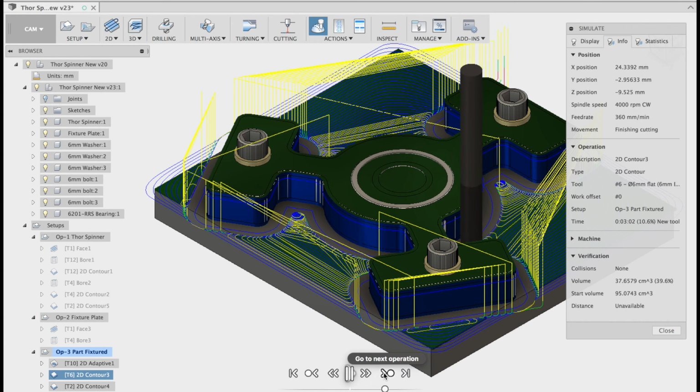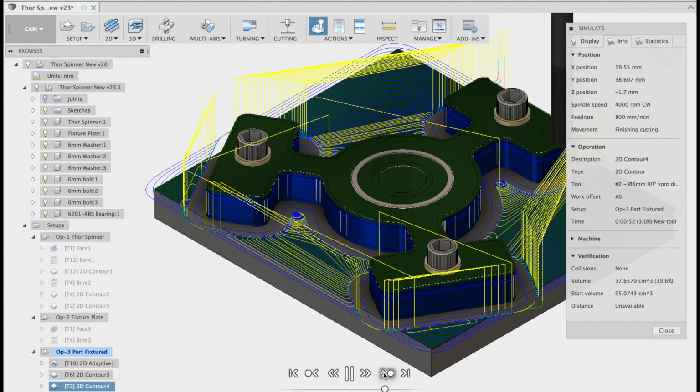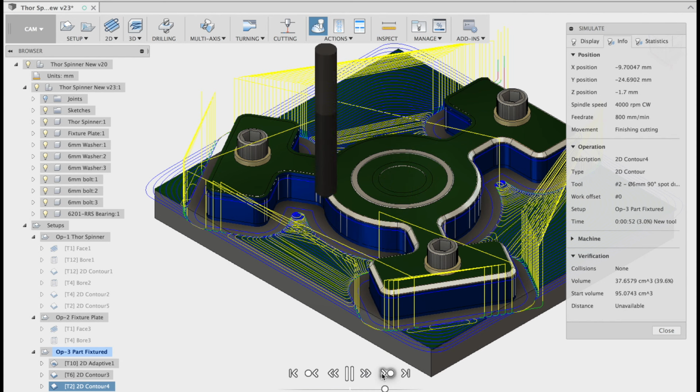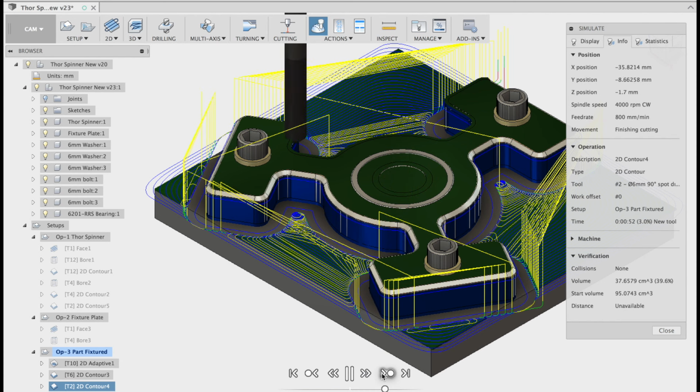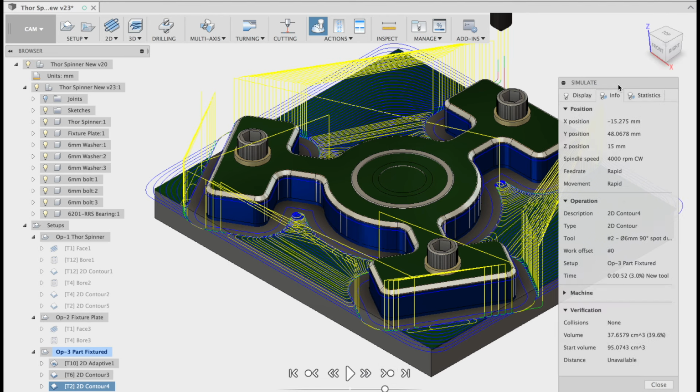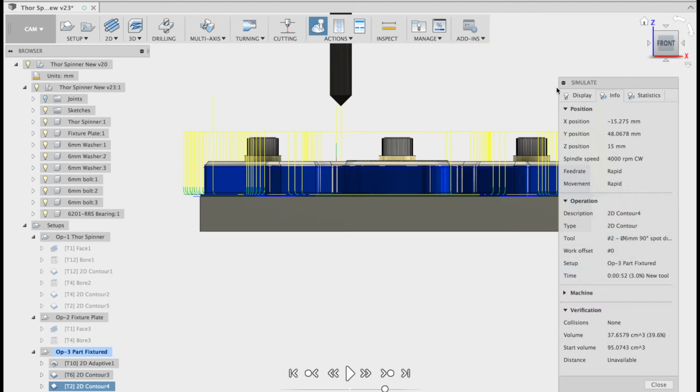We then come straight in now with, I think we do two passes of that, we repeat the finishing pass, then we come in and we put that lovely chamfer on the outside. That contour. And you'll notice here, guys, that in my heights, I've actually ensured that I set the height up so the chamfer bit, if it traverses across the part, will miss those cap heads.